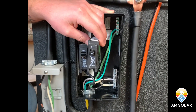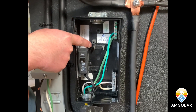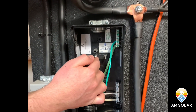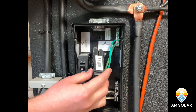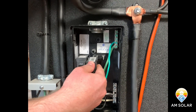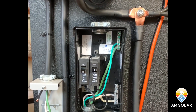Something that seems to trip everybody up is: how is this getting fed power? You can see back here there are these metal prongs. If this breaker is getting power from the inverter, these metal prongs are also getting fed power — they have continuity, you just can't see it behind the plastic. So if I take these and pop it on, now this breaker has power, and now my outlets will also have power. In theory, they should work.